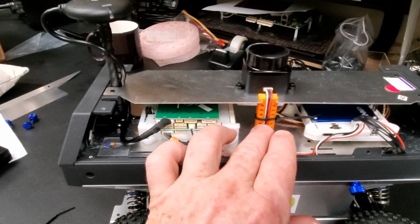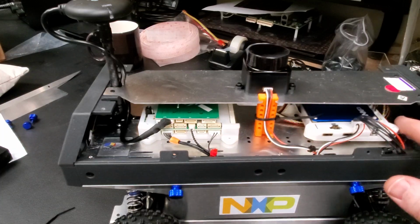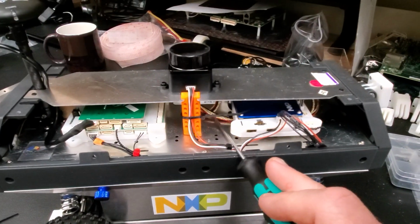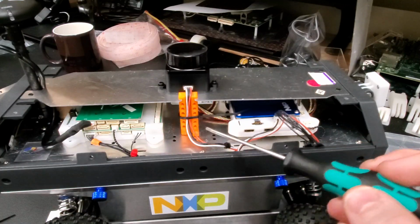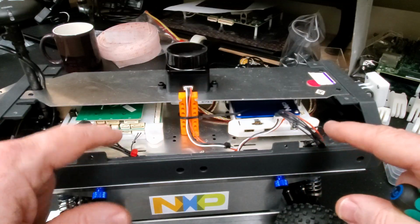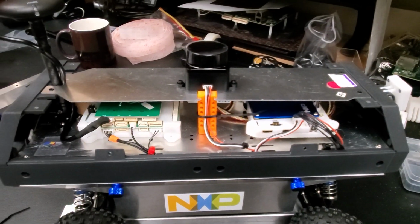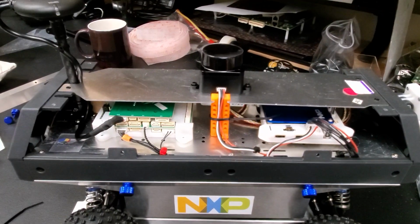You can see the jack stand. We zip tie that. I think that's it. There are CAN bus wires up here that we just plug in, and they don't go anywhere at the moment, but they could, and they will probably be used for a demo where these two boards talk to each other. But generally, those two boards talk via the T1 Automotive Ethernet. Those CAN connections will then go to other peripherals that plug in, like a CAN connected GPS or another CAN connected peripheral in the near future.